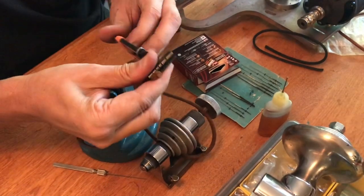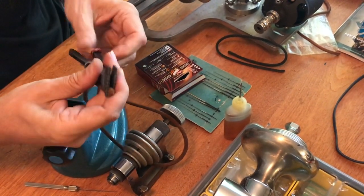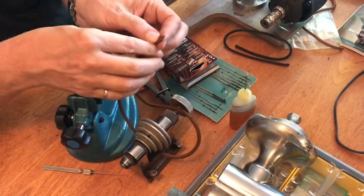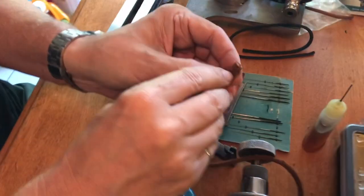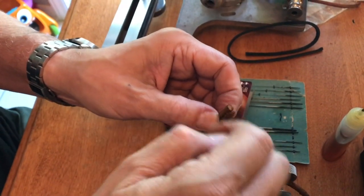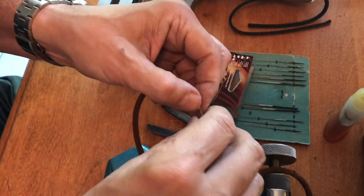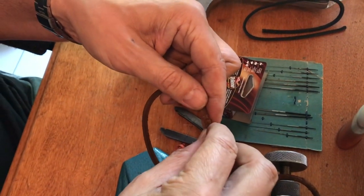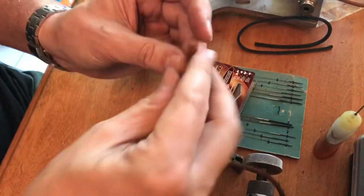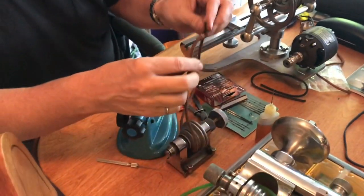Once you have this configuration, remove the rubber band and take the pieces off — they'd be parallel and stuck to each other. If you sew these really tight, you will not be able to open it, so the tip is to sew it a little bit loose — make the loops just a bit loose — so that when you open it, the fishing line is the right tightness. Don't sew it too tight. Once you've done this, you open it up and you've got a belt for the lathe. Install it and you're good to go.